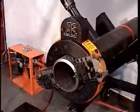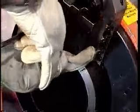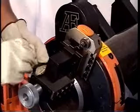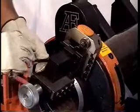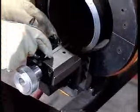After severing and beveling is complete, the air motor should be removed for the counter boring operation. Trip assembly should be disengaged or removed, and one of the two slides should be removed. Raise the tool holder to 3/4 of the height of the tool slide. Remove the tool and tool holder cover plate. Install the counter bore attachment over the tool holder using bolts from the tool holder cover plate. Rotate the ring so that the counter bore attachment is at the bottom.